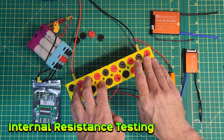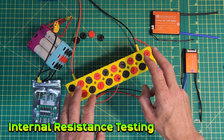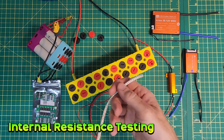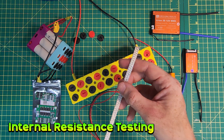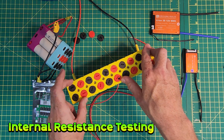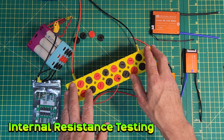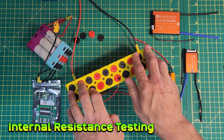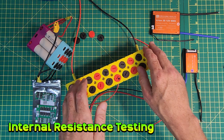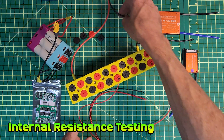After doing the vibration testing, the next thing I wanted to do was test the internal resistance of the braid connections. All of the connections are made with tinned copper braid which is a quarter of an inch wide. There were some concerns online that that braid would add far too much resistance and would heat up and cause problems with this kit. So in order to calculate it, I've actually removed the BMS units from the batteries — taking them out of the equation — leaving just the cell connections with the braid and the wire outputs.